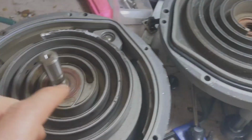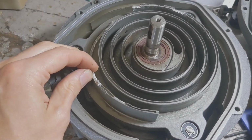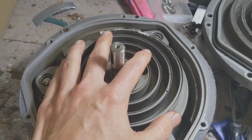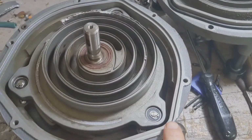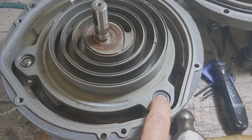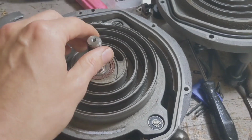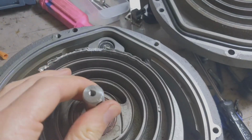So the tip seal, again, you may have noticed this is damaged. This is what happens if you don't change the bearings. Oh, okay, that's new. But anyways, this particular pump was my first pump that came with my freeze dryer. And this bearing here basically shattered. While I didn't know what was happening at the time, all I heard was a metallic tinging sound. And eventually the whole thing seized up. The motor was humming, no pumping, nothing happened at all.